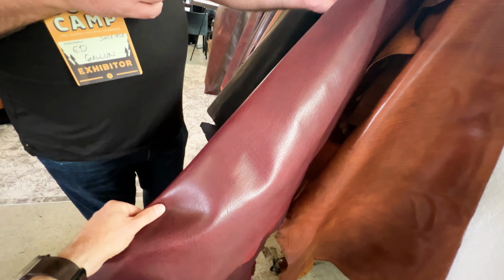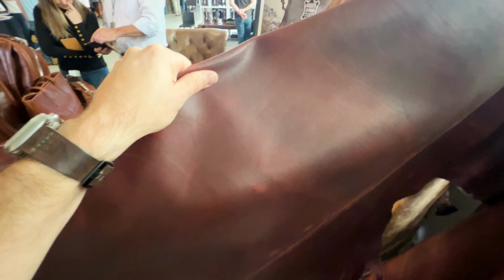What we did is we partnered with a meat producer, and he gave me a dozen hides to play with to prove how good it is. We ran this in chrome. It's just literally stuffed in the drum. It's wet stuffed, ironed, and we're milling it in the crust, and then we're just finishing it with wax and then topping it with a bright roll.